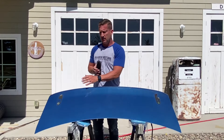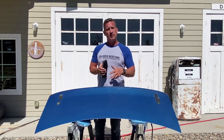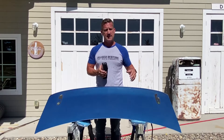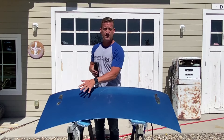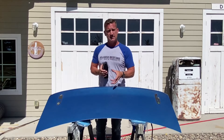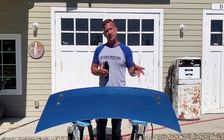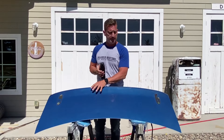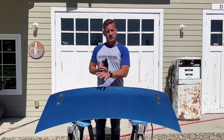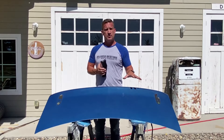We're going to scuff this up with some sandpaper. I'm actually going to use a little air-driven DA. You can do it by hand, you can do it with an electric sander — whatever you want to do — just want to get it scuffed up so that you get that mechanical bond with the coating. Then we're going to make sure it's degreased and has no oils or any other contaminants. I'll show you the prep, then how to use the spray gun, and then I'll also show you how to roll it on so we can show the difference between those two.